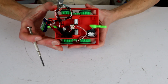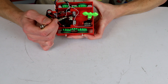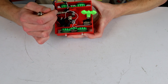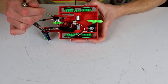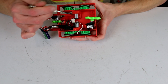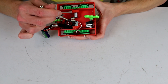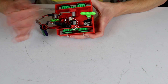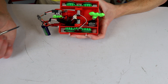Now the problem with this, as you can probably see in here, is we can't put the motors at the same point — if we push this motor forwards it interrupts all of the stuff for the weapon mount. We can't move this motor forwards and we can't move this motor backwards because it hits the weapon servo. So we're actually going to have to go one up and one down, which means this thing is going to be a little bit interesting in terms of packing on the inside. But I think that's the only way I can do that.